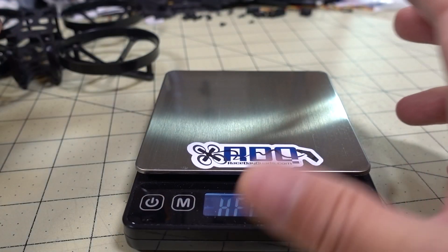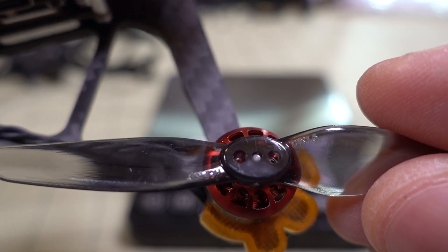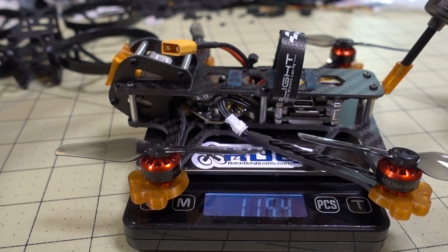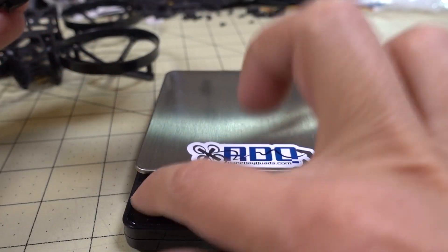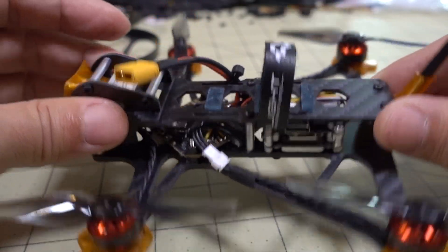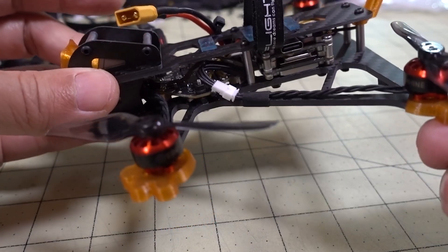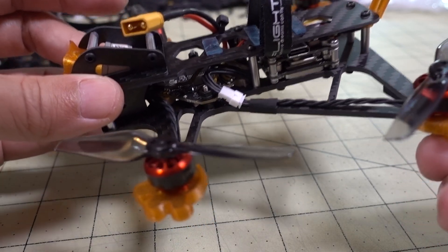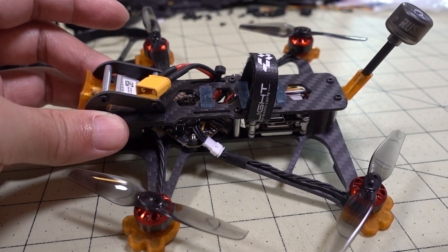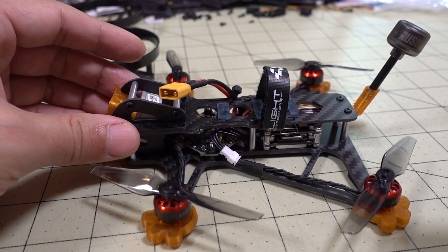Let's see how much this weighs. I'm going to use the HQ T3 props — these are the 1.5 pitch ones, T3x1.5. It comes in at 115.4 grams without the battery, and I'm going to run this on 3S — probably a 520mAh 3S, one of those long slim ones, which should give it a pretty good flight time. You might be able to run 4S if you put a throttle cut on, but on 4S with the 5000KV 1204 motors and 4A ESC, it's probably going to be too much. If you want a little more flight time, you could go 4S, but you'll need to make adjustments — otherwise you'll probably fry an ESC or motor. So just run a 3S 520. I'll link a battery in the description.